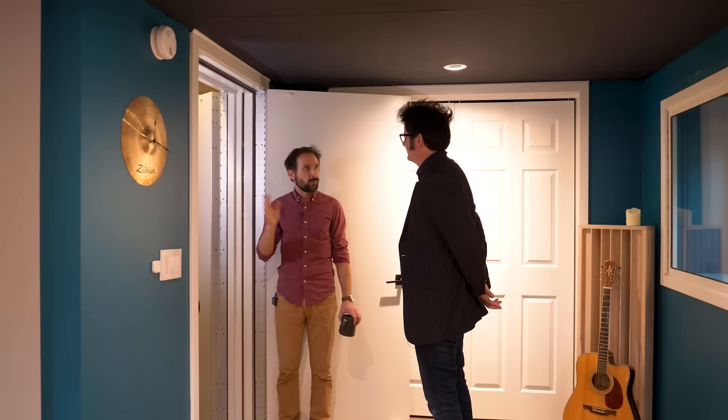The whole point of this really is to make this room airtight. You could, in theory, fill this up with water, and it would be watertight, too. Any sort of hole, that's where the sound gets out. So we spent quite a lot of time patching up all the holes with silicone. And low end, if you're pumping some sub stuff? We have a sub in here, and we'll maybe show you a little bit later. But low end, you can't stop that. The mass on each side of these walls is thick enough that it does a really good job. If you're at like 110 decibels and you have the sub on, sure, you can hear it, but it's really, really muted.